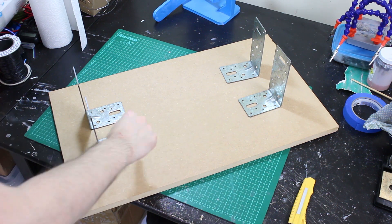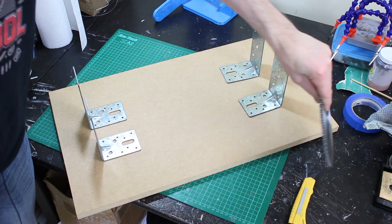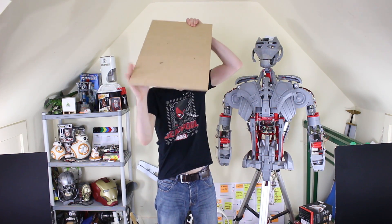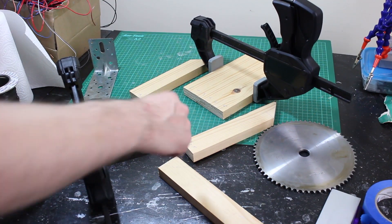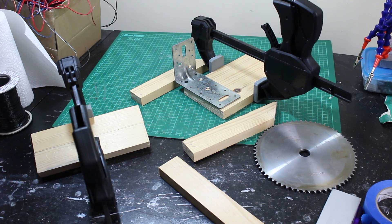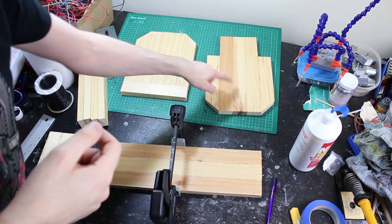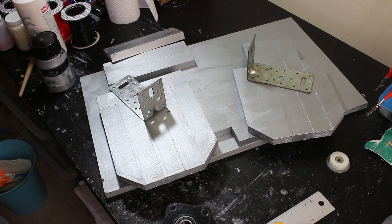Here are my brackets that go top and bottom, here's my sprocket, and we have the block and tackle mechanism. It looks about the right size compared to me. I've cut various bits of wood — these are gluing up at the moment, and even though they're glued edge to edge, the metal brackets screwed across should add loads of strength. Here are my tops and bottoms that the bearings go on — we need to drill a 20mm hole through for the studding.